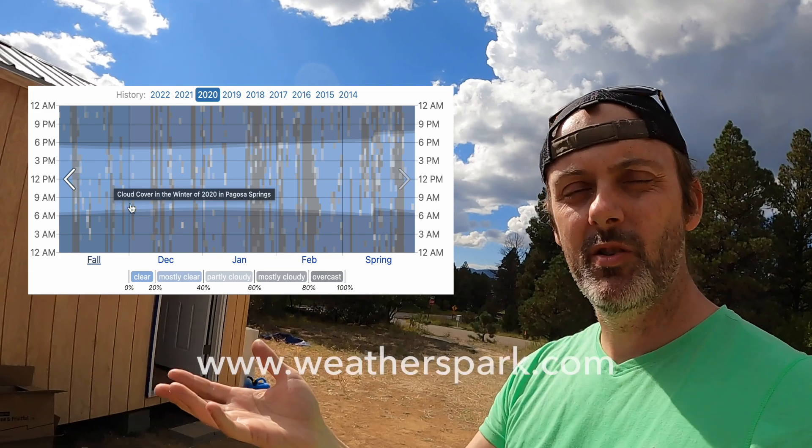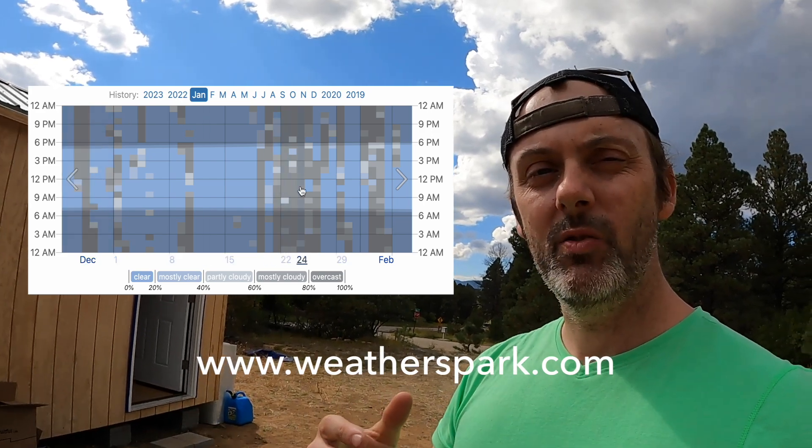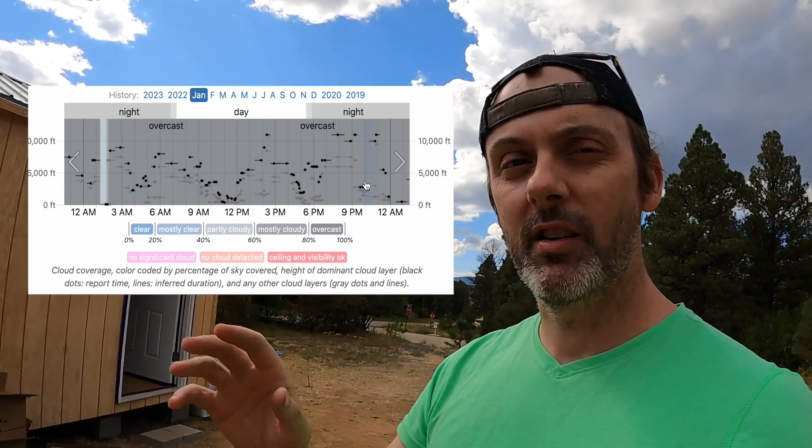I had to calculate my power needs and then look at the worst possible case, which is probably December or January. I'll put a link below, but there's a tool that shows your weather on average anywhere in the world — you can type in a location and it'll tell you not only your average temperature, but how many days of the month it's sunny and how many are overcast. You need to calculate your daily power use and multiply that by however many consecutive overcast days you see. I looked at the past five years in this area and found I needed four days of energy storage, which was about 300 amp hours.